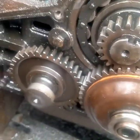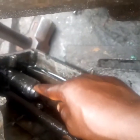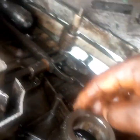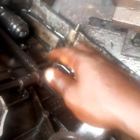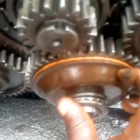This is the crankshaft — you can see the crankshaft there. Those are the lobes that control the injectors, and this is the injector itself — the injection pump. It's a single-cylinder injection pump. You can see the governor or speed control that is controlling the injection pump. That is what helps the engine speed up or slow down, depending on how you set it.